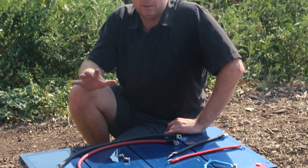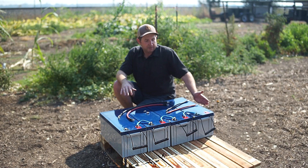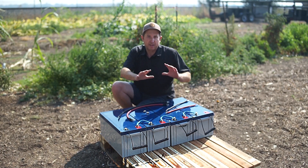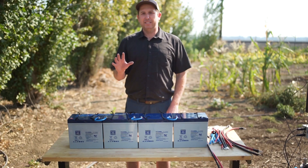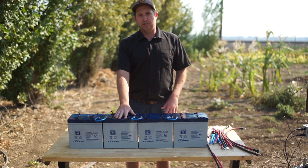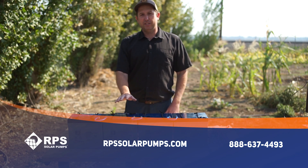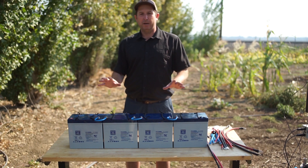As you can see, it's a very simple setup. It really helps if we lay out all the batteries in the same configuration — positives on the left for each set — making series and parallel jumpers straightforward all the way down the line. That's the basics of laying out both 24 volt and 48 volt battery banks, whether using small or larger batteries. It's very simple, and a uniform layout makes everything much easier. If you need these gel batteries — they're going to last a long time in extreme conditions — give us a call at 888-637-4493 or visit rpssolarpumps.com. We can help you lay out your battery bank and get you set up with a robust off-grid system.